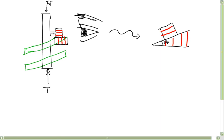And what loads are acting on this block? The weight, and that's going to be acting just straight vertically down. And then there's going to be some force that's produced by this torque, right? The torque is being applied to the screw. So you can sort of picture, if you think about this block sliding up this incline, that torque is pushing the block up the incline. We'll get into how to calculate that later, but I'll just call that a horizontal force Q. Okay.